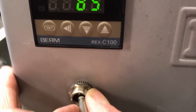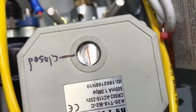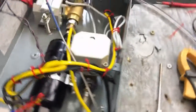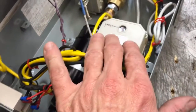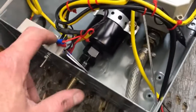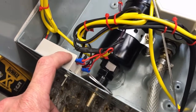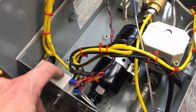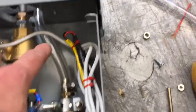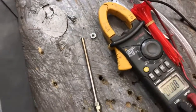That has brought our process value way up. I'm going to hit the trigger switch — that has caused the valves to open. Now they don't open on their own when they hit the trigger point, and I think it has something to do with the batteries inside these specific valves. A constant current is being held on this solid state relay and they don't like that. Both these valves are connected in parallel so they both turn off and on.